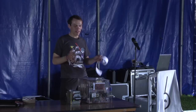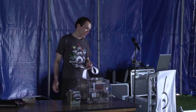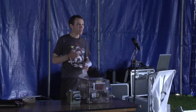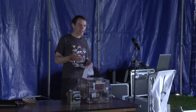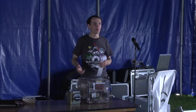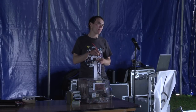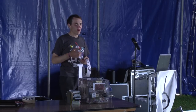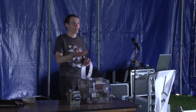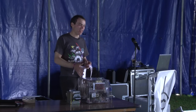I built the ALU first just to check the one-bit ALU idea works. With a bit of tweaking and debugging it worked exactly as planned, so I added some registers to make the ALU unit. Then I had to work out how to control this thing — I came up with an instruction set, as simple as possible to implement. There are eight bits on the punch tape: the first four bits are the address for that instruction and the second four bits are the instruction itself. These were entirely designed to be as simple as possible to encode into a relay computer just using the wiring.